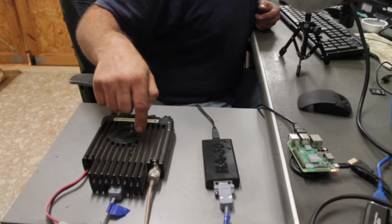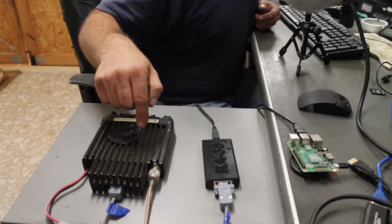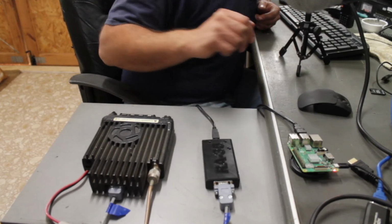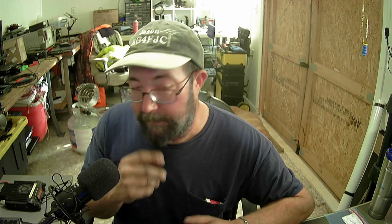That's all it is. Well, when you turn your radio off, that goes to ground. The interface thinks that, oh, there's a signal coming in, when there's actually not. So be very aware of that. You never want to just turn off your node radio, not while you're connected up. If you disconnect from any other connections and you turn it off, who cares? It doesn't matter. It's not going to do anything. So just be very aware of that. There is a way to change that so that it doesn't. But again, this is a very simple, basic Allstar node build.